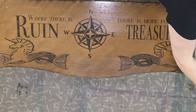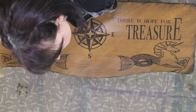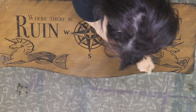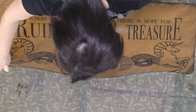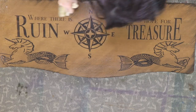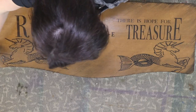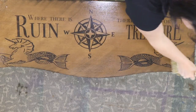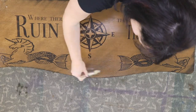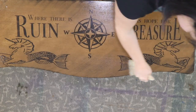And so as I've been buffing the tung oil finish into the unicorn spit, this is on bare wood. So the unicorn spit is sunk down into the wood. This is like a giant sponge I've been applying this to, basically. So that first coat went on and just absorbed right down in it. And I love that. It started getting a low gloss look to it, and that's whenever I knew that it was enough and I could go over and do another coat, just based on the look and the feel of the wood.